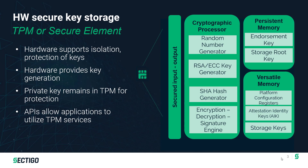Looking deeper at the hardware secure element: it's a TPM chip or other secure element built specifically for cryptographic operations and key isolation for IoT devices, with a number of vendors providing these solutions. It's a physically separate hardened chip that generates keys on the device. In the case of RSA or ECC where you have a private and public key pair, the private key never leaves the chip. Any cryptographic operation is performed by passing data to the chip via APIs, the operation is performed using the private key, and the result is passed back out. The public key can be shared via dedicated APIs.